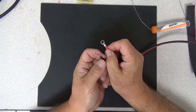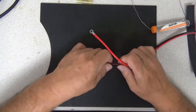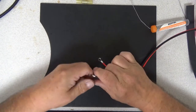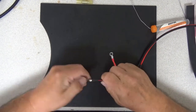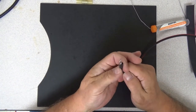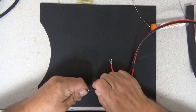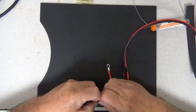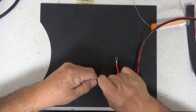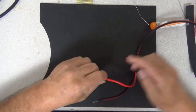These didn't wick too bad — I've got wicking up to about here. I don't love it, but I can live with it. I've had it wick all the way back by using too much solder. The hope here is that I've got the heat shrink going on. I don't really worry about pulling on this too hard, because it should not come apart. There we go. That's what I was looking for. Now let's see how we do on the other side — hopefully it'll be a little easier. And yes, this is much easier. I have my heat shrink in place.